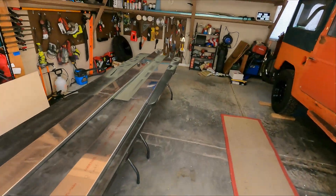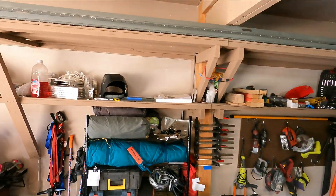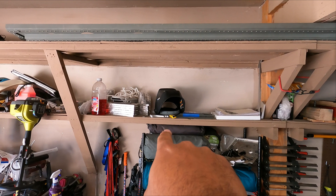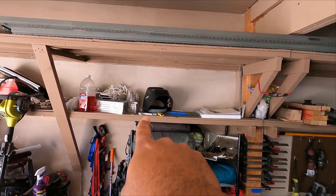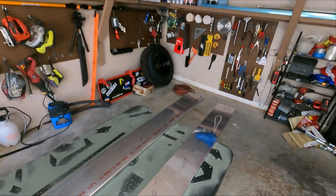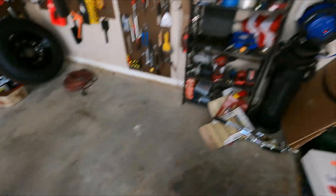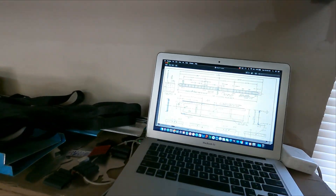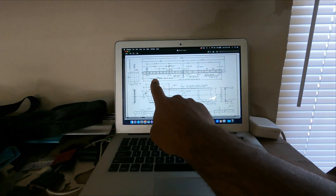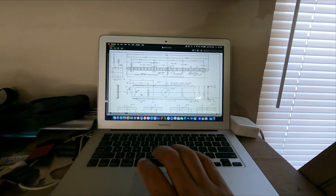The goal today is to use the center wing root brackets, mark them up, drill some pilot holes, and then according to the plans, mark everything in its location related to where the ribs should go.